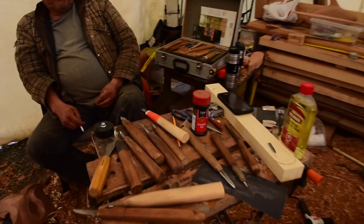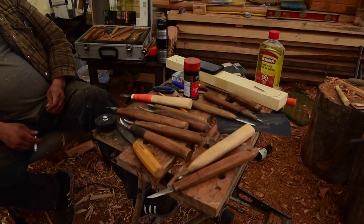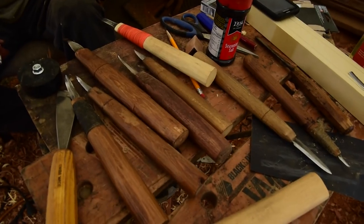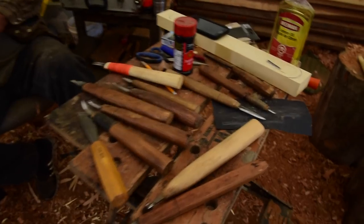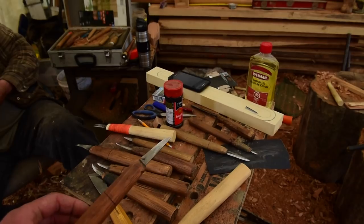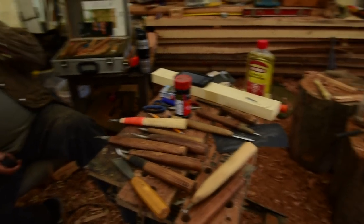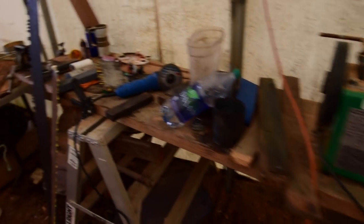You can see some of his tools here. Tom and his brother Perry basically make all their tools — most native carvers do here on the island. You just take a chunk of cedar and an old file or saw blade, soften up the steel, then shape it to all the different profiles you need. Here's his little sharpening station with a couple of bench grinders, leather strops, and oil stones. He uses old hand saws and swede saws to cut smaller pieces, and makes his blades from old file stock — using good steel cheap.